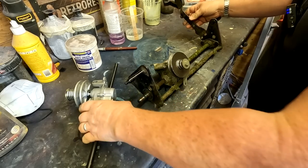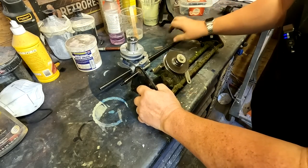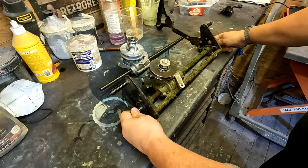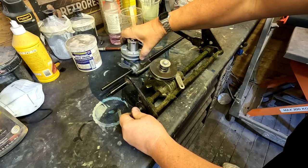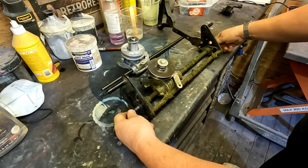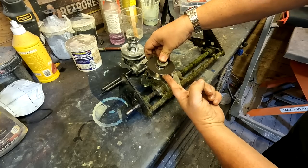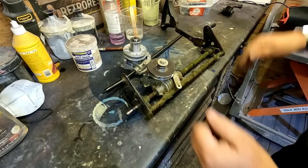So that's how it sits in our lawnmower. There's a slight variation — I think this is an updated one. The owner had this from new so this variator has never been replaced. You can see that old one is really naff compared to this solid new one. There is absolutely no way that old one was tensioning the belt enough — it would just cause it to slip. Look at it, absolutely ludicrous. So I'm going to get this new one back in and hopefully the belt tension will be sorted.